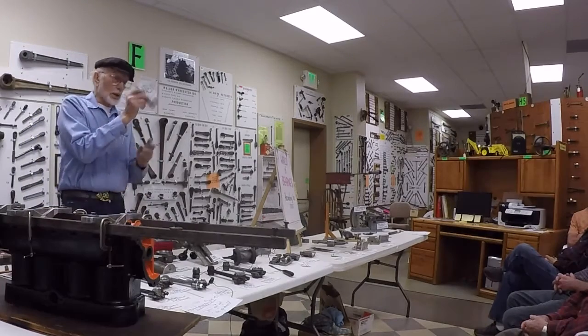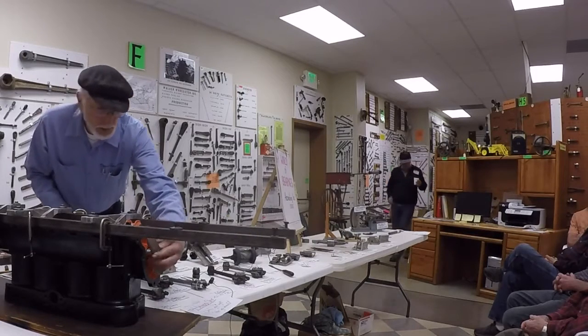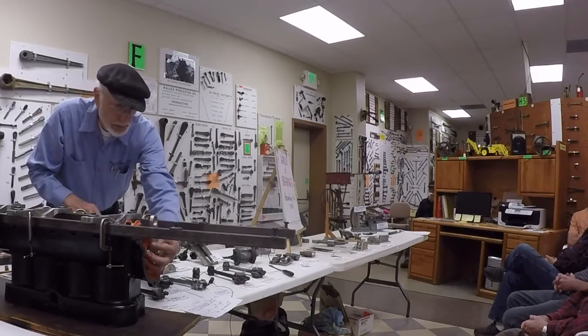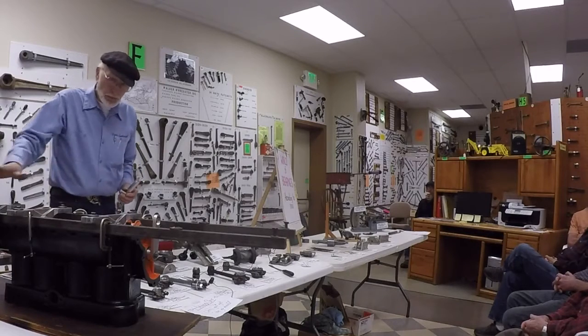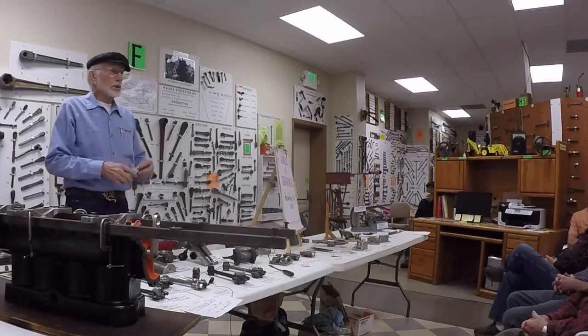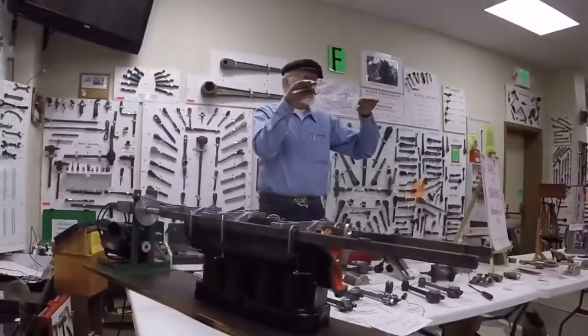This one's got the big dog nut on it - it goes out here in front, and then the bar comes through to that, and this one goes in the back cam hole. Even if a guy surfaced the pan, which rarely happens, sometimes guys have that surface just to move things down a little.